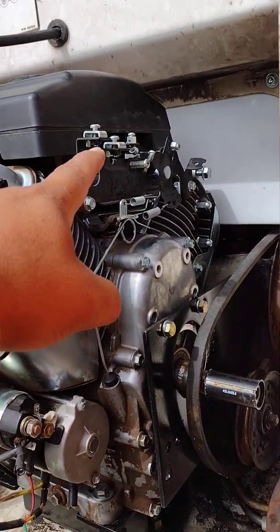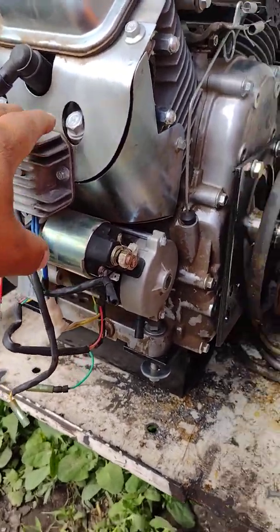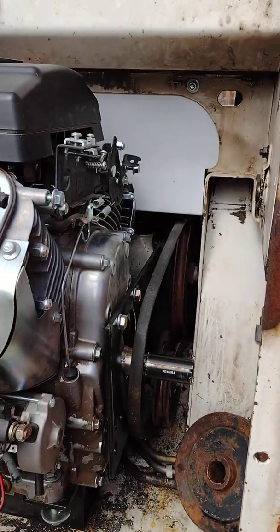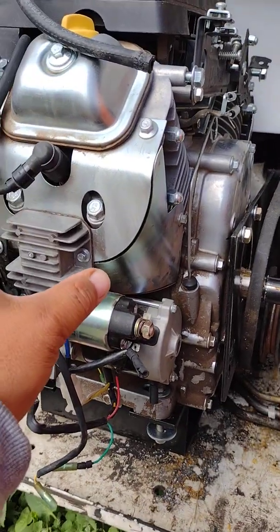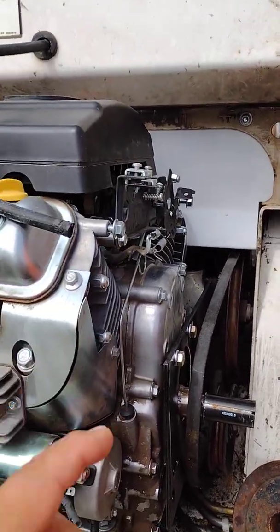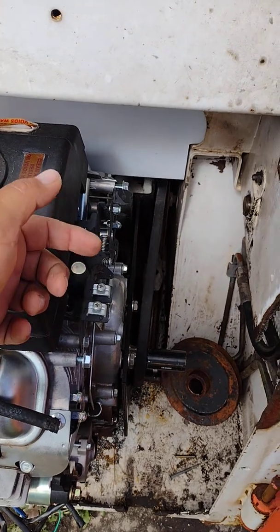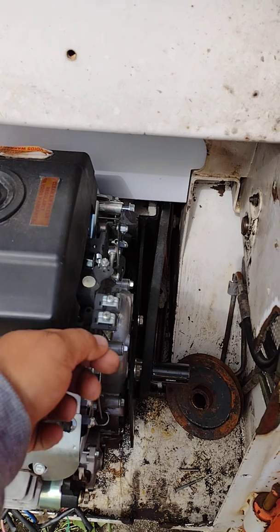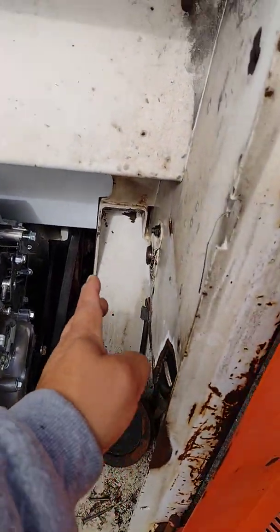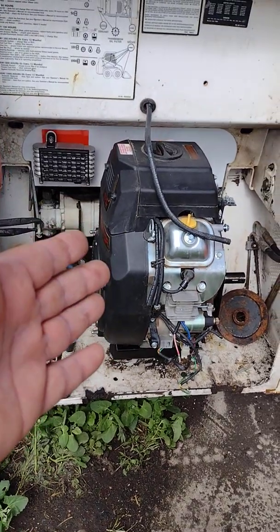We're going to see on the next video how I hook up the throttle body and the electrical system, because I don't want to start the Bobcat from the back — I want to run the cables through the original hole on the firewall. There's a hole up there and I'm going to run both the electrical cables and the key ignition wires through it. I'll just extend the wires so we can start the Bobcat from the cab. This throttle body is activated — the butterfly — by pulling from the cab. It goes this way, so the cable has to curve and then go into the firewall. We'll see that in part three.